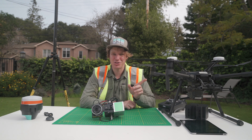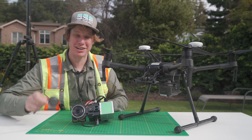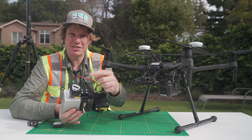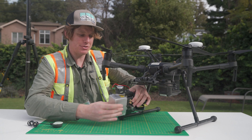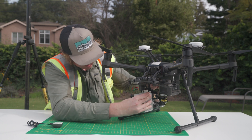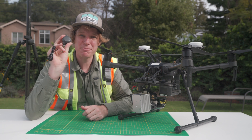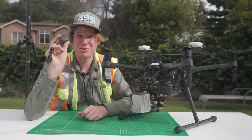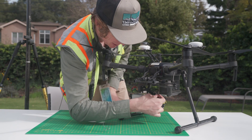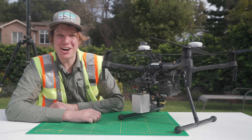Now let's cover installing the LiDAR to the drone. The ROK R2A comes in two components: the aerial scanner and the GPS puck. On the DJI we have the Skyport adapter which allows us to just plug it in and lock it on — it's that easy. The other component is the GPS antenna. I'm just going to double stick tape it to the top of the drone and plug the GPS into the LiDAR. And there you go, the LiDAR is installed.